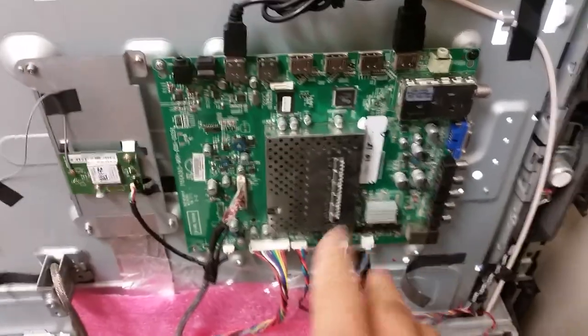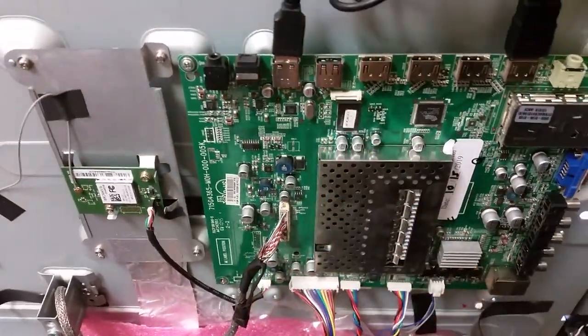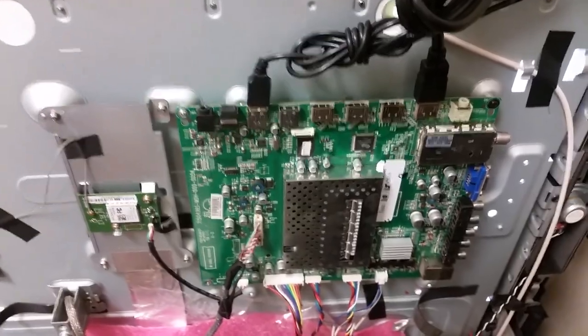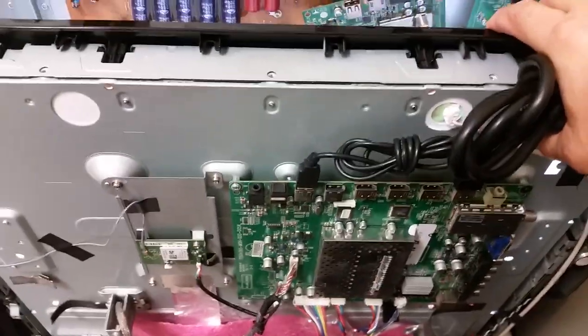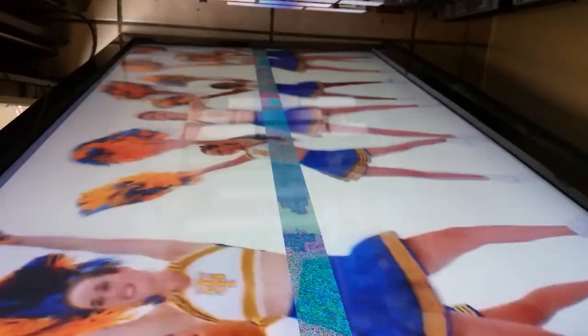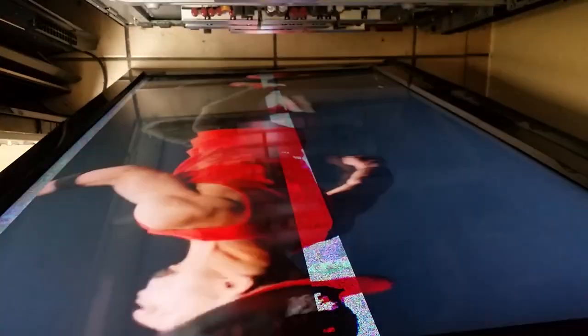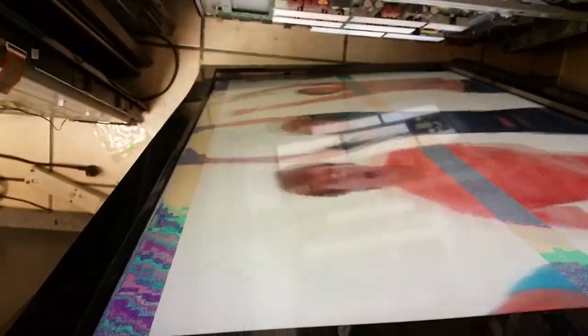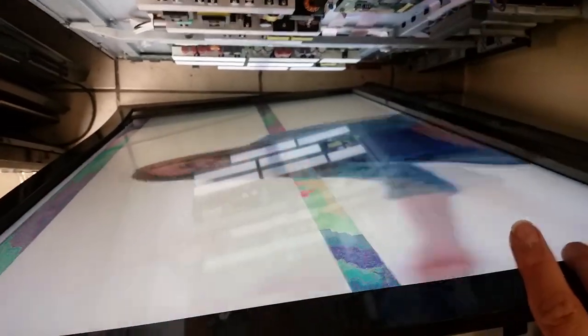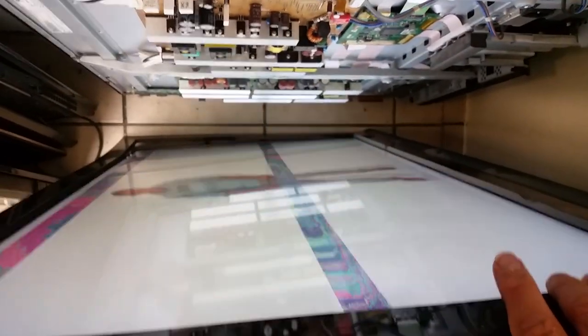The main boards, even though they look very much alike, differ in that the E422VA does not have that connector. The two boards at first glance look exactly alike, but there are minor differences. The output signal is also slightly different between the two, which is why you see a line moving down and another appearing — this will not show on an actual M421VT.